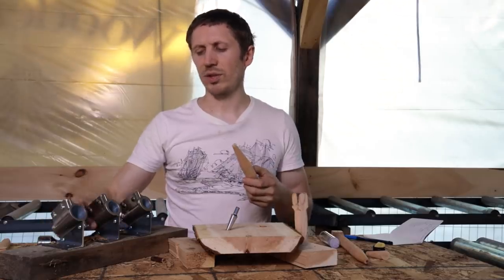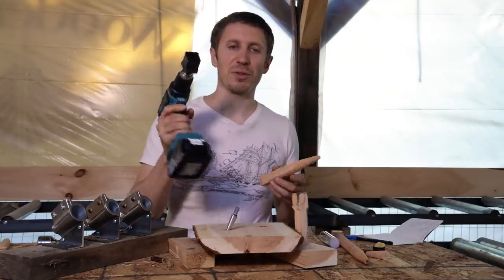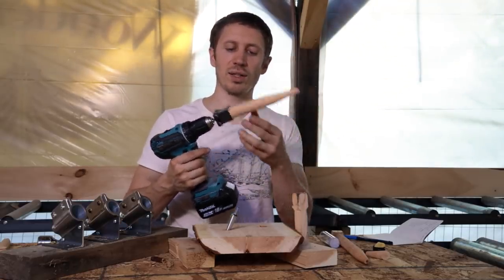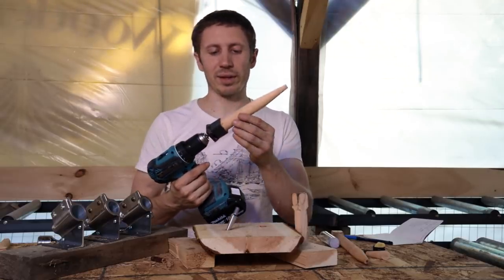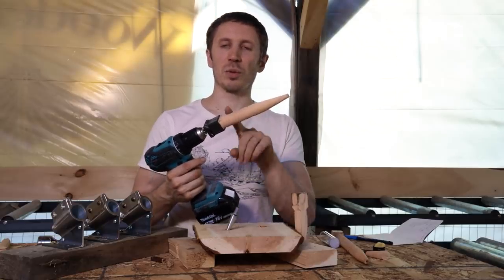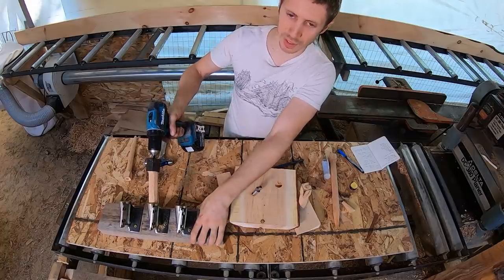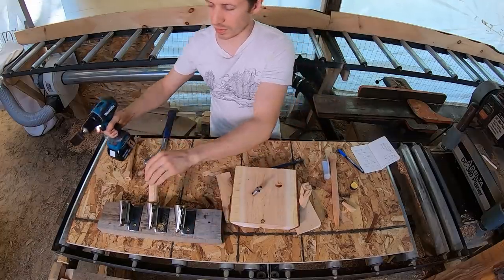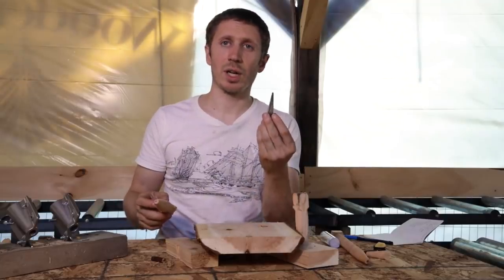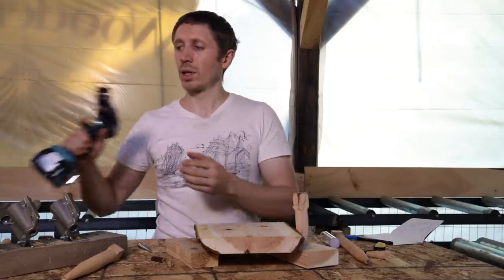And it's a little slow and doesn't work very well by hand, so we actually manufactured a little bit for our drill. So all we got to do is make a piece of stock like this that has a square end, fits right in here. And then on the lathe in the garage, we, not the metal lathe, we have a wood lathe, would basically make a round dowel, and then that fits right in here. And as you turn it, it basically makes the plug. Now that we have our dowel and we have the tapered cutter, let's ream out this hole and we'll show you exactly how to do that.